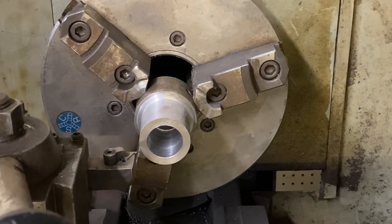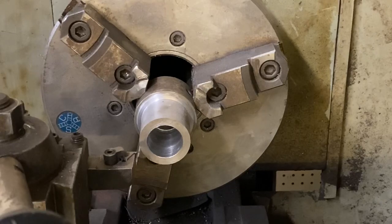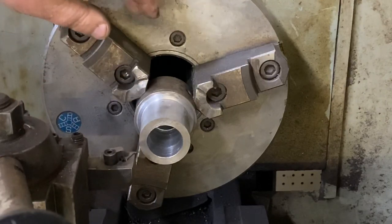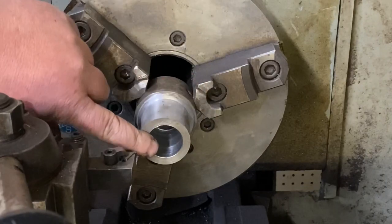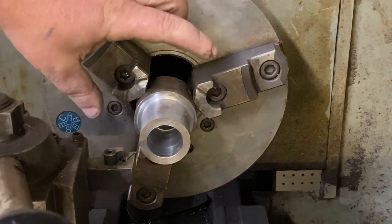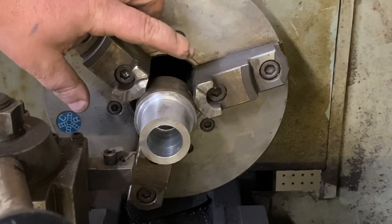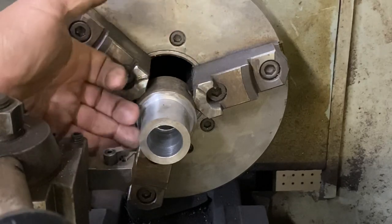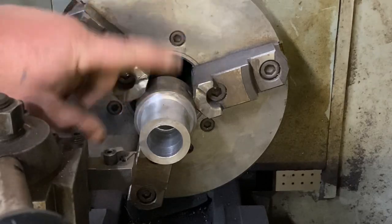I've done work for him before. He has a pretty good scrap pile from tearing apart machines. So this is the piece he brought me. We'll get the sides to dimension, face it there, get the depth to dimension. Tolerance on this project is plus or minus 5/1000ths. He's probably gonna bring in the other plate part. It's got some wear in it, I guess there's a guard underneath it that traps water, so it's pitted on the bottom. So we might clean that up and put a bushing in it to match this.